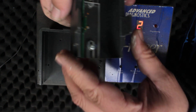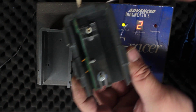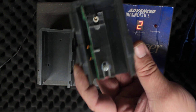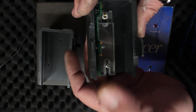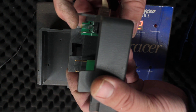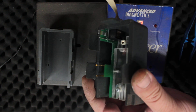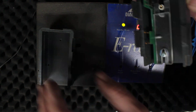Under here it actually does inline programming — it picks up half of the SOIC chip there, then connects to another point, and these two points here seem to be some sort of ground so it doesn't corrupt anything. They're spring-loaded — like little tall bullets, spring-loaded, pretty cool. This one here got bent and now I've got to find a replacement for it, so that's annoying. That's one of the reasons why I kind of stopped using it.